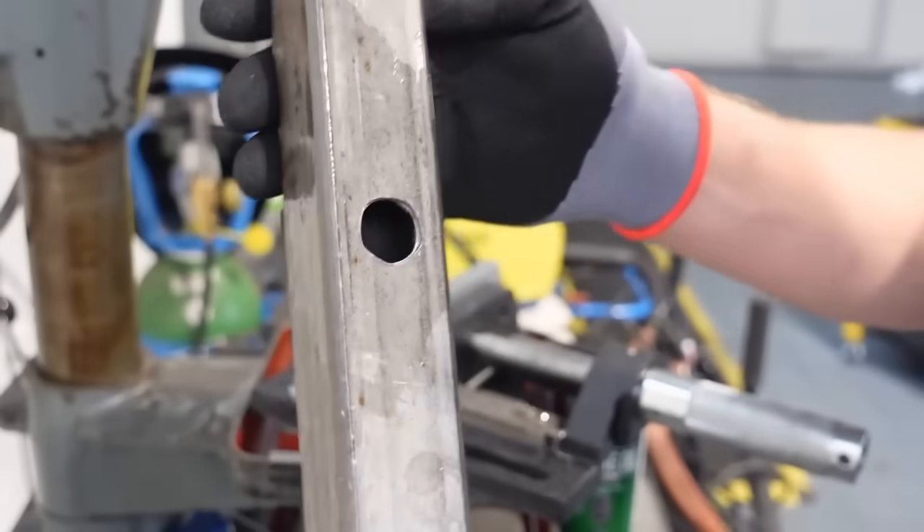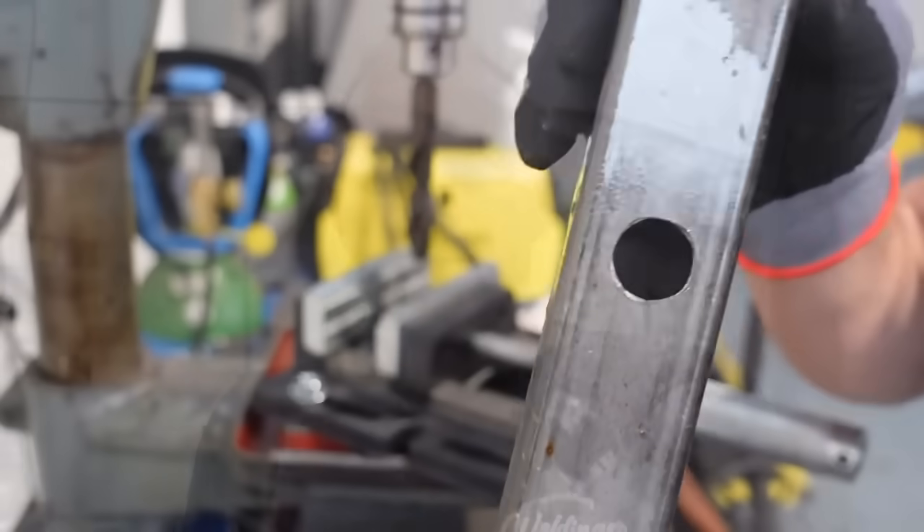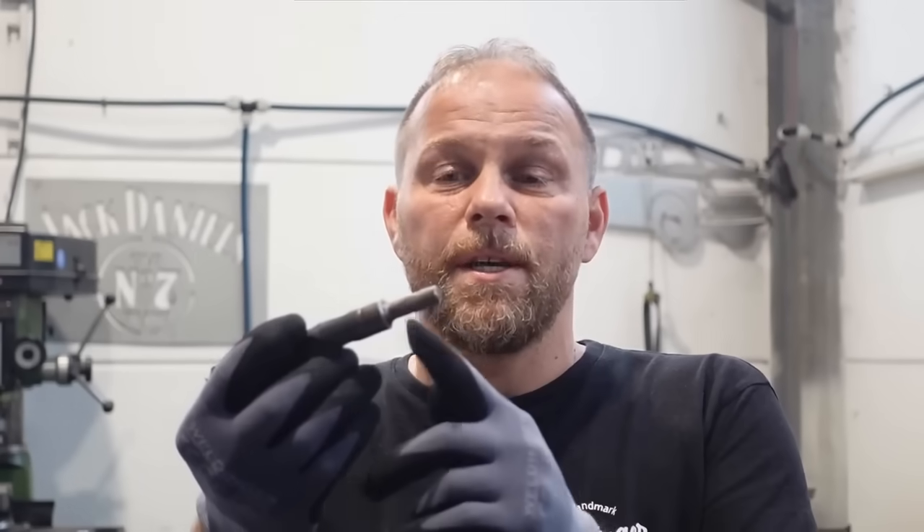Looking at the result, the shape is far from perfectly round. Sometimes it's a triangle, sometimes it's five-sided. Now, for the hexagonal hole — this is a regular twist drill. This one here is turned down so that you can also hold it with a chuck.